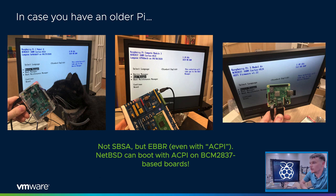What if you don't have a Raspberry Pi 4? Can you still use this UEFI and do interesting things, like development for UEFI bootloaders or applications? Yes — we still make Raspberry Pi 3 releases and actively maintain that code. Very recently I added support for the Raspberry Pi 2 64-bit variant, revision 1.2, where they ran out of 32-bit chips and started putting on 64-bit ones. Compute Module 3 and 3 Plus should work as well, along with the diminutive Model 3A Plus with only half a gig of RAM.